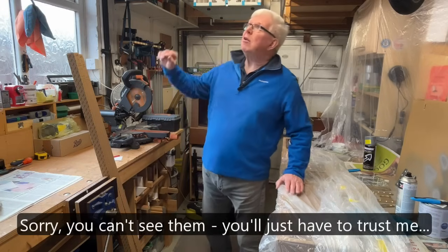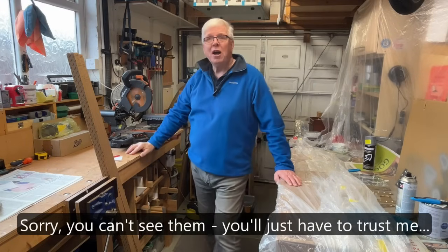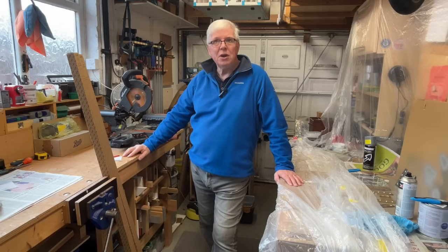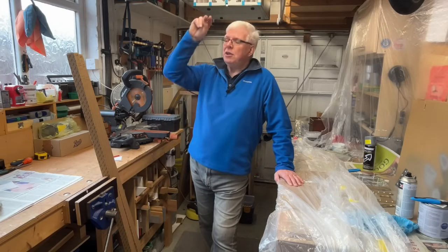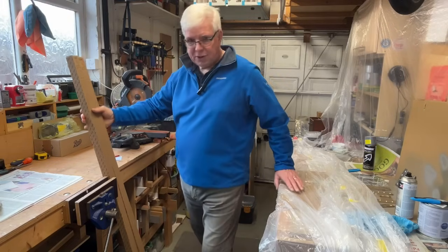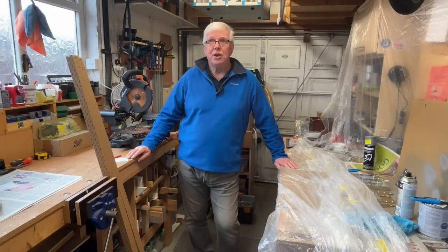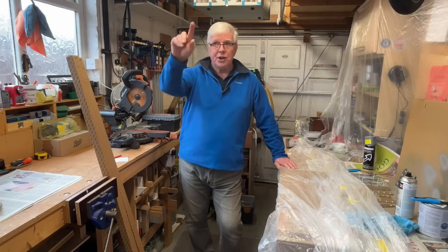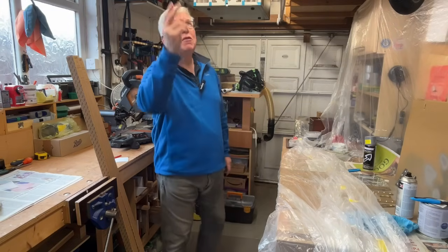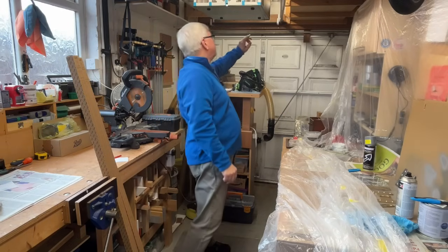Both of these tubes above here are working fine, so I thought I'd take one of those out, move it to where the failed tube is, and replace both of these with LED equivalents. It's a good opportunity to try them. I've got four fluorescent tubes in this garage bay: one single behind the camera which is the one that's gone kaput, a double fitting here, and then a single fitting towards this end.